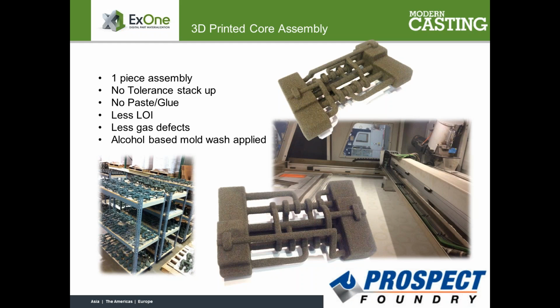But I think ultimately what people should understand is that from our ExOne adoption centers, we certainly do our best to maintain high quality cores, and those that have machines certainly try to do the same. But one big thing is the 50% humidity that we try to lock in our shop here, plus or minus a few points, that allows us to use a consistent amount of binder and activator throughout the year, and have lower LOI, higher strength. And as you had mentioned, Greg, your LOI was what initially with the traditional cores? Right, we had over 3% LOI with the traditional cores.